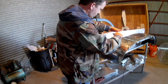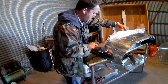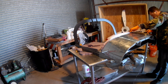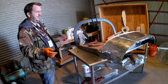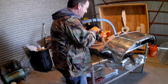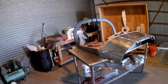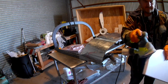Anyone who might remember — I think it was an elevator skin — I had a skin issue where I dimpled all the metal in the wrong direction and I didn't feel comfortable using it, so I just ordered another one and put it on the wall of shame. Well, that's great because that thing is more than long enough — I think it's 52 inches long and the whole width of the piece here is 50 inches. So I cut off about two inches from the very edge and we're going to use it as the extension. It does two things: it makes sure your piece is big enough, and there's also a tiny lip at the back, so even as you're drowning the layup in resin, when it hardens you'll see that lip all the way across as a very easy guide to cut.